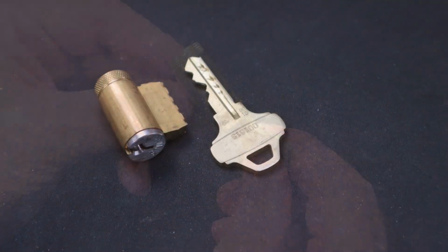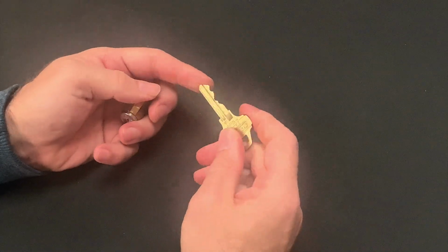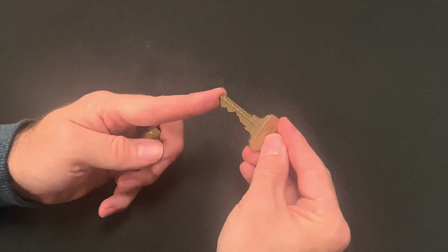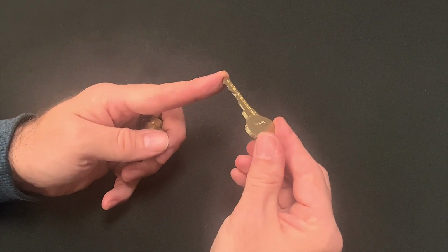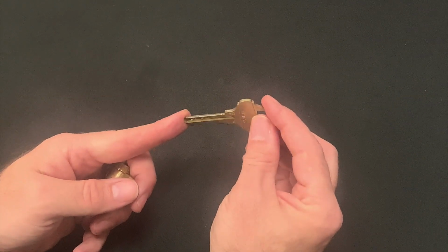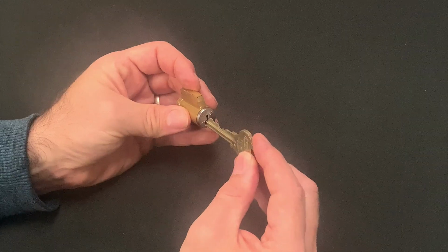And now a very special lock, a Schlage Primus, another Everest design with a milled key, but in this case this milling is to accommodate the sidebar which this high security lock has in place. So not only does this have a series of driver pins held under tension by downward pressure on the springs in the bible, but at the same time there's an additional row of sprung pins that are pressing at a 90-degree angle to the core, which must also be negotiated before this lock will release.